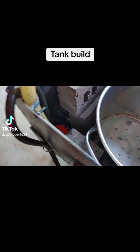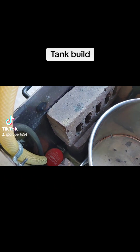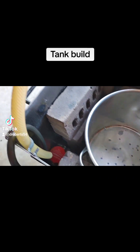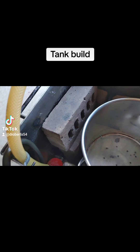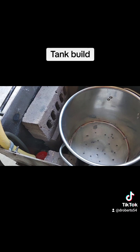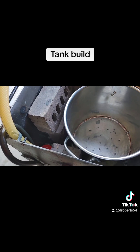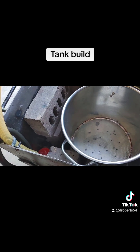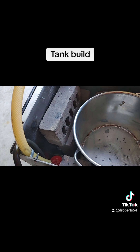I have a little pump inside that circulates the coolant as I'm running. It's also very handy for emptying the tank when you're finished running shot. The bricks are in here simply to act as heat sinks and to take up some space — without them, the tank holds a little over 10 gallons, and I'd need an extra gallon beyond my two five-gallon buckets. The bricks help keep the coolant cooler longer.